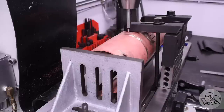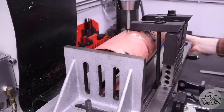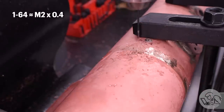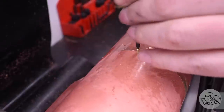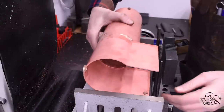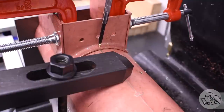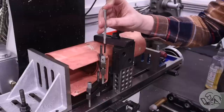The next job is to get a whole bunch of fixturing screws all the way around this assembly. I'm using a similar setup as I did for drilling the rivet holes, but this time using V-blocks underneath instead of the vise. I set it up on the seam and then I'm very carefully drilling and tapping tiny little 1-64 threaded holes around this joint for little tiny brass fixturing screws. These are to hold everything together during silver soldering. The drawings specify seven of these screws in various strategic places around the joint. This was a pretty slow and tedious process, but you've got to really take your time to keep from breaking any tiny taps, drills, or screws. The upper two screws on the throat plate sides serve an additional purpose which you'll see in a moment.